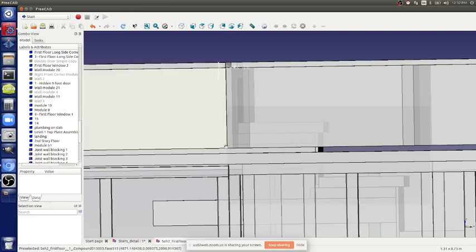Yep. I'm sorry, what was that? That is a 3/4 inch of the subfloor? So it turns out in our CAD that we have a 1 inch extra rise on the last step. Is that acceptable? No, right? Okay, can we transfer that 1 inch to the first? Oh yeah, there we go. So on the first one, we have 7.5, but there's the landing there. Oh yeah, we can put it there.